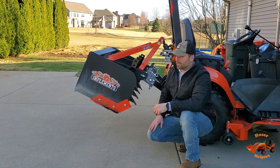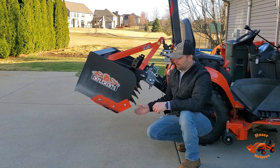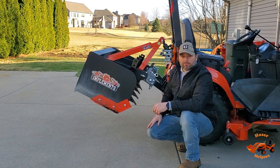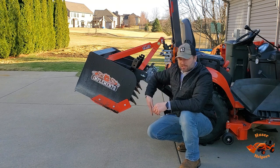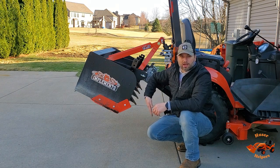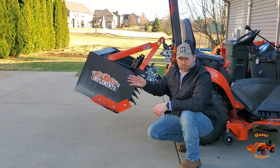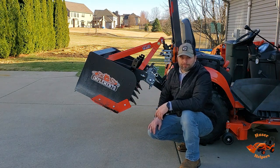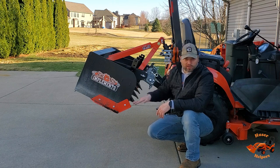Going through the full range of motion with this hydraulic top link and the PAT system — I'll show footage of when I first put the hydraulic top link on, demonstrating the limitations and range of motion with the box blade at that time. In the raised position we're getting more height out of it, which helps for unloading off the trailer and backing off. Even though we're not swinging in quite as much on the bottom side of the cylinder stroke, we'll still have plenty of engagement with that back blade for cutting back.